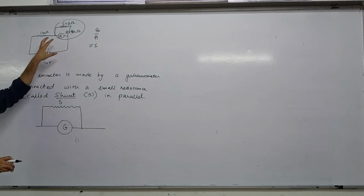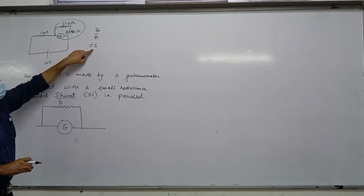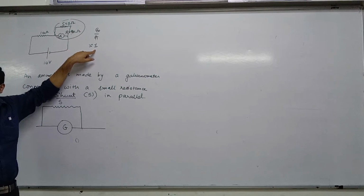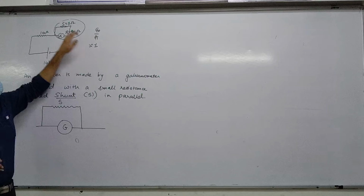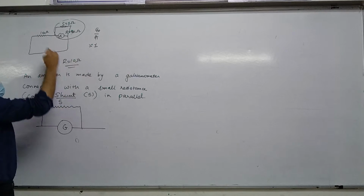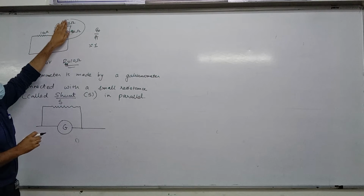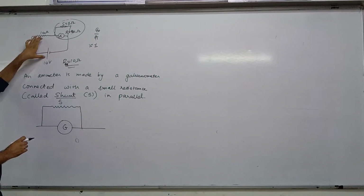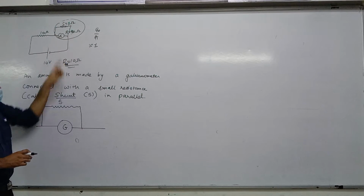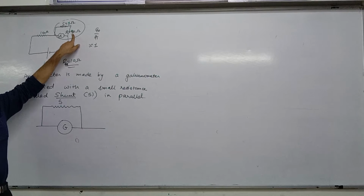So, do you see, even though we have connected an ammeter to measure, it only increases the resistance by about 1. Without this, theoretically, the resistance is 10 ohm in this circuit, and it becomes 11. You remember what we were talking about in the morning: if you just calculate it, 10 volt, 10 ohm, 1 ampere current should flow, correct? But if you connect only an ammeter, which is just a galvanometer with resistance 90 ohm, then the error will be big.